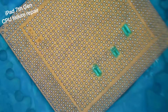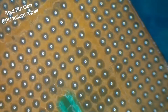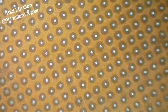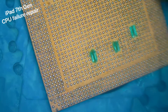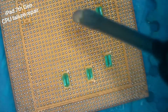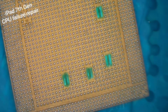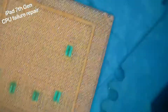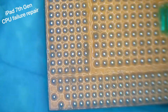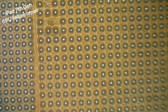I noticed when I had done mine, one ball had moved but it was easily rectified - sadly I didn't capture it on camera. I just put a little bit of solder and flux on that pad and moved the ball back. Now give it another coat of flux, reheat everything and get everything centred so we know all the solder balls are connected to the pads. Give it a good look, see if there's any stragglers, get rid of any imperfections and it all looks good.